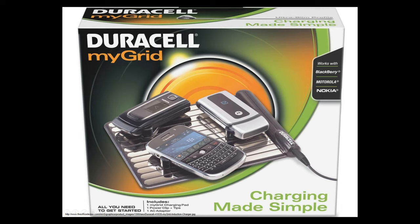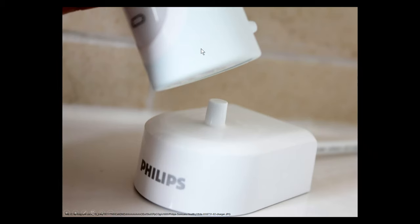So this is the same principle of being able to, like how I was able to light up that light bulb without actually plugging it in. This is how we can charge a phone. And those are old phones now, aren't they? The Sonicare toothbrush, that's not any metal connection you make in there. There's just a coil of wire on the inside and a coil of wire here. And the alternating current here will make current happen through there because of the changing magnetic field.